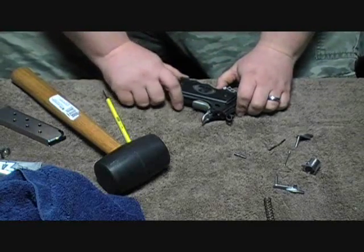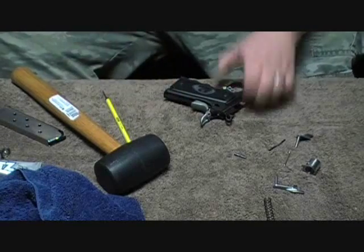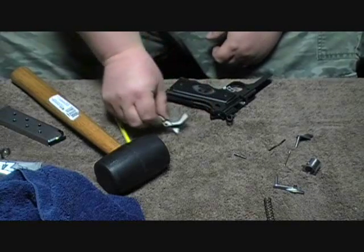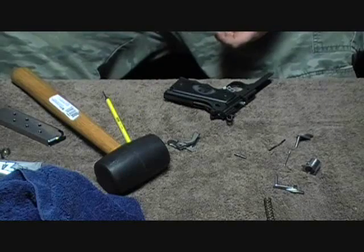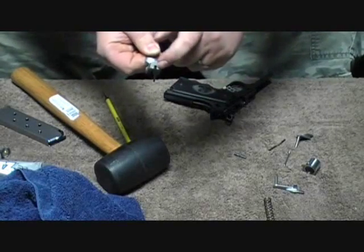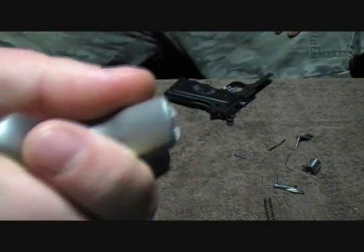Next thing is just slide down your main housing just a little bit, just like that. It'll stick out probably 1/8 of an inch or so. You can just pull your beaver tail out like that. It'll just come out. Your mainspring housing kind of keeps it in with some ridges there, guys.